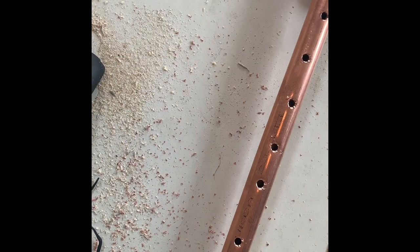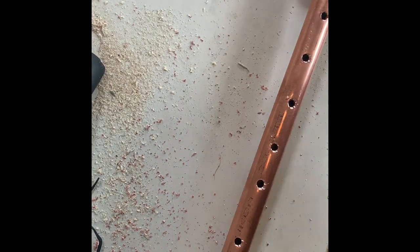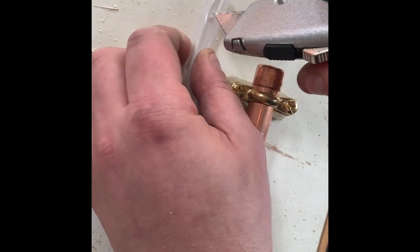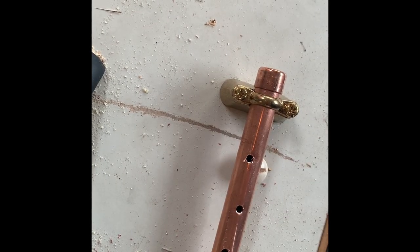The heat resistant tubing is to encase the lights and ensure that if they ever get a slight split in them, this isn't going to become a live tube. Measure it out and then put a slit where the wires are going to go — obviously this would be on the reverse side of where the lights are going to be shining.